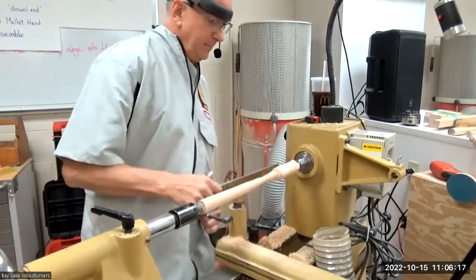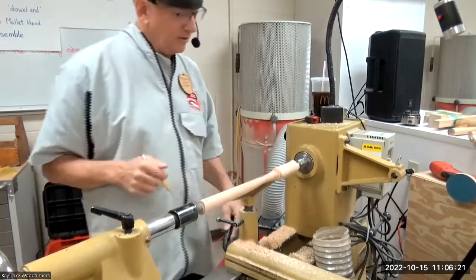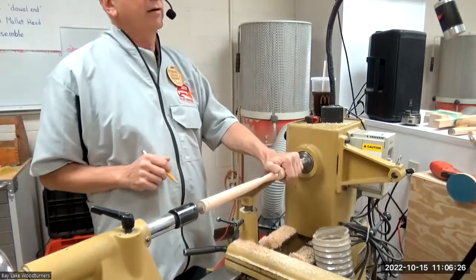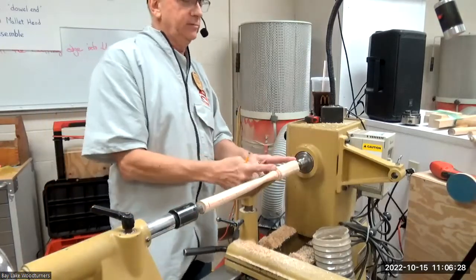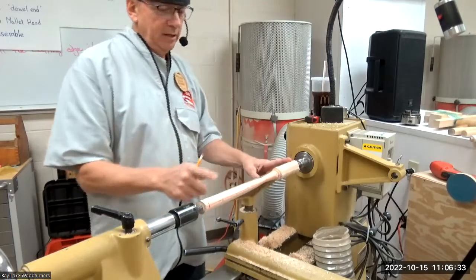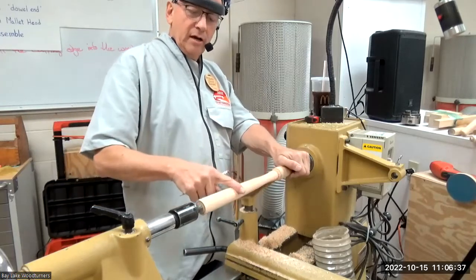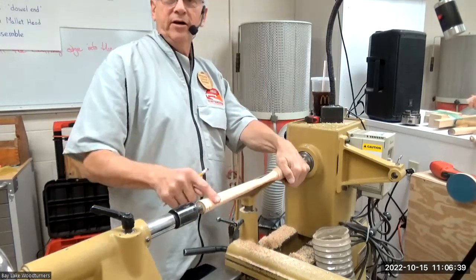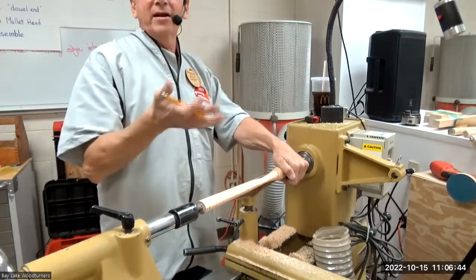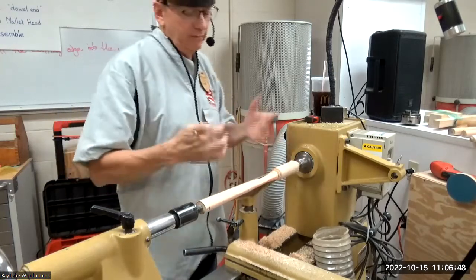Yeah. All right. So as this gets thinner, obviously you're prone to more vibration. That's why I leave this part for last, because if you had a 3-4 inch chunk of 3/4 inch hickory in this case, you're going to get more vibration. The good thing though is when you're turning off center and it just keeps hitting and then it goes, it doesn't get the harmonic vibration like you would if you were holding it on a round cylinder. So that part's good.